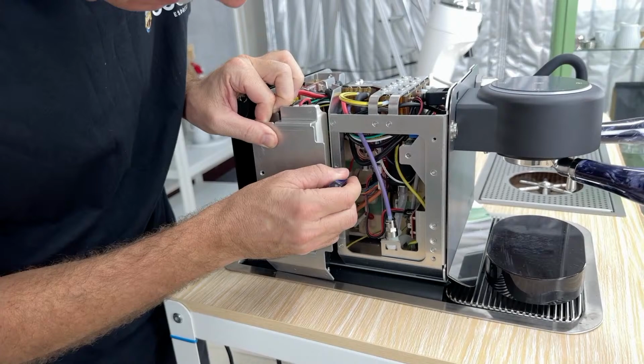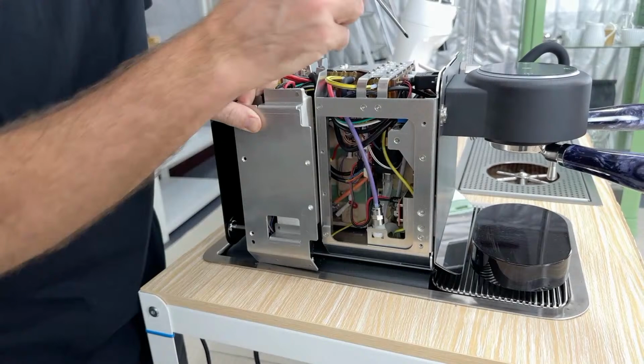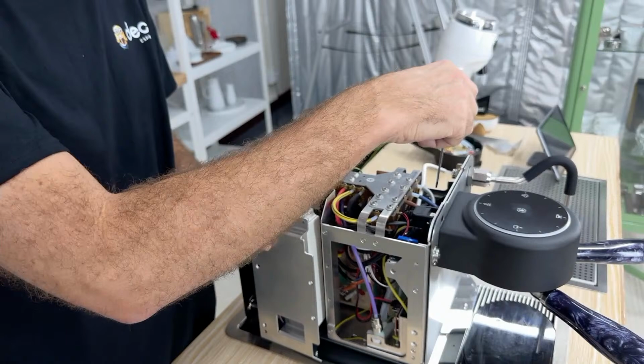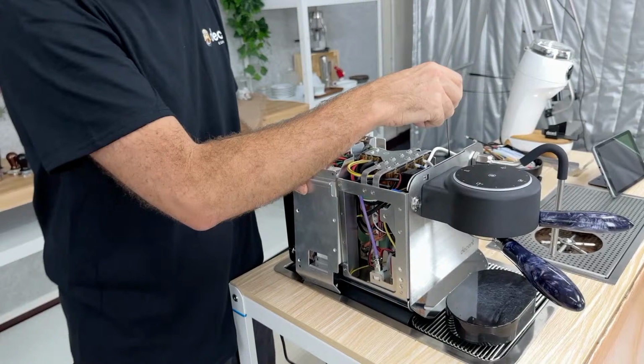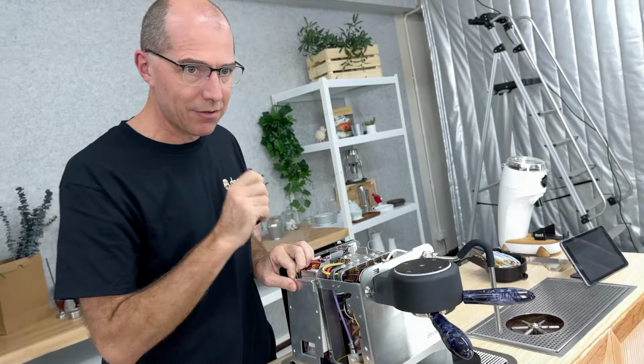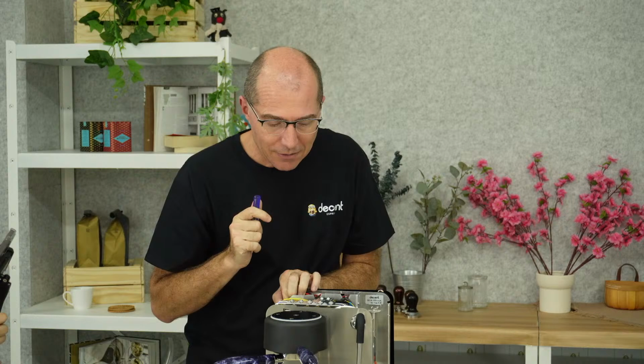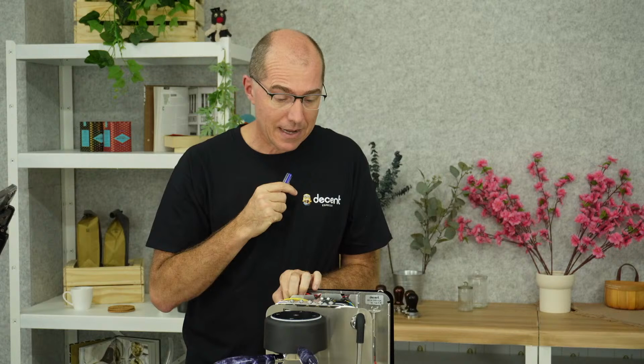And what's unusual about this is that this tube that goes here does not have a valve. And the reason it's important is that it allows us to heat our steam at energies that would not be allowed in a traditional boiler. A boiler is limited to, I believe, 2.8 bar of pressure, after which the safety authorities are worried the boiler might explode. And so we don't have that safety constraint because we don't have a valve here. It's open to atmosphere. So our double XL model hits pressures typically in a 4, 4.5 bar, and the triple XL model we've been testing goes all the way up to 6 bar.